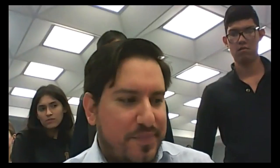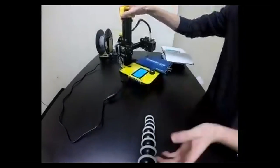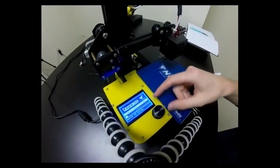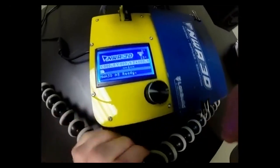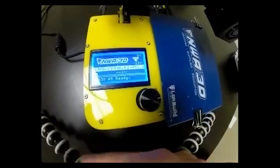Have you encountered any filament issues? Not yet. For loading filament: first, go to Prepare on the printer menu. You'll see options like Disable Steppers, Preheat PLA, and Preheat ABS. We've changed the preheat settings — the preheat PLA or ABS is set to 100°C for what's called a 'soft pull.' A soft pull is used when removing filament, changing filament, or clearing a clog.